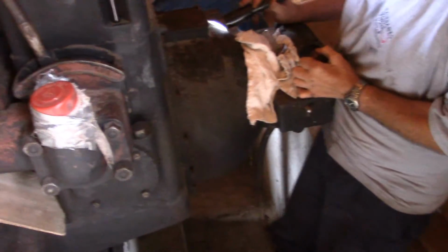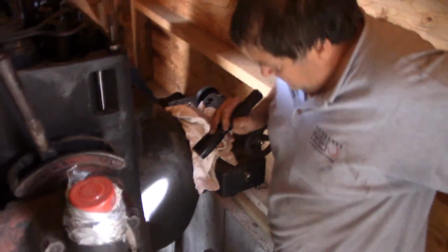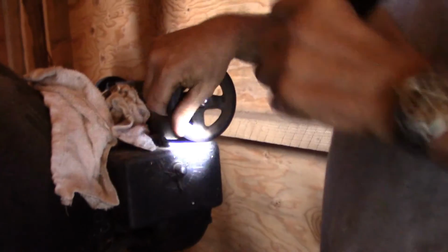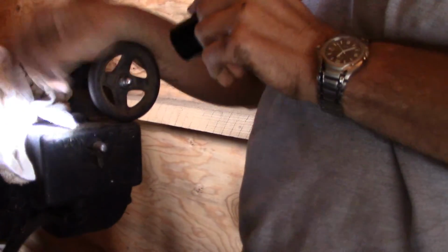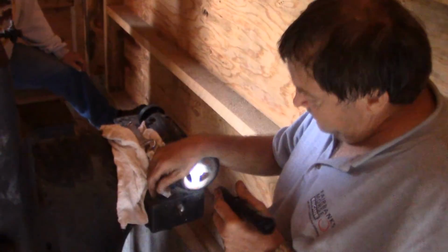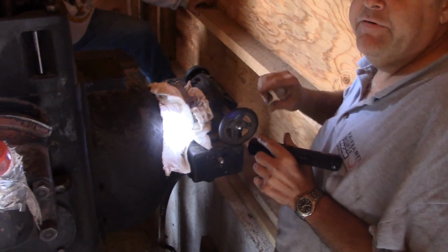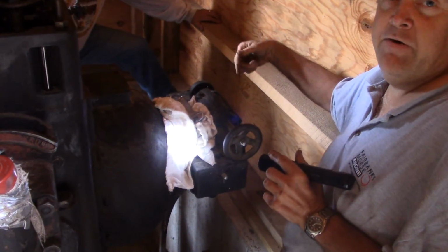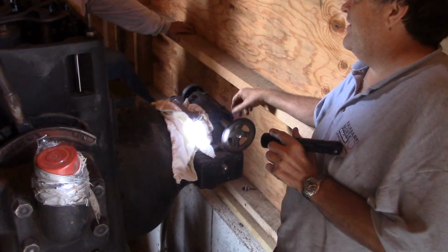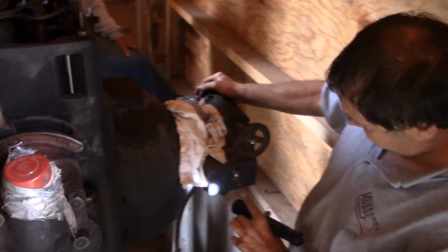So we won't need that synchronizer motor though. No. We'll just use that hand wheel. You can use the hand wheel. Looks like that one's turned up a good bit. Maybe when you clean it, you might want to bring it down to the slow position just for startup. Yeah, it'll take a good bit of turning because this is a pretty fine adjustment. It was actually made for a regular motor. Do we have any idea where it actually is right now? There's an indicator on this side, the dial there, fast, slow.